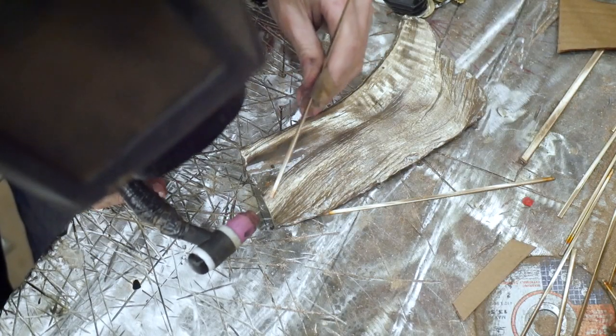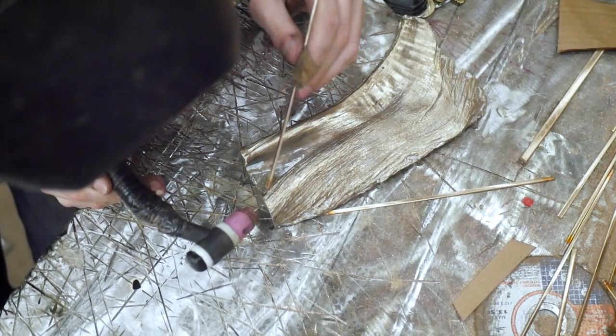If I can see the exact problem area, I just add a small bead weld along the edge to fill in that particular gap. This messes up some of the surface texture, but I'll be able to fix that later on once everything is fit correctly.